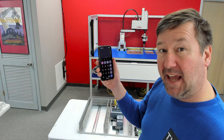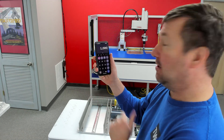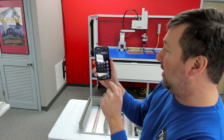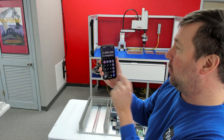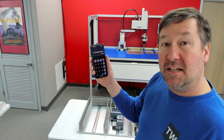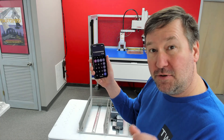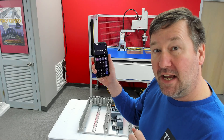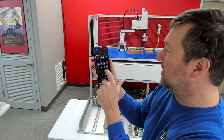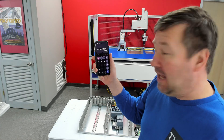In my case, I have a 1kVA transformer — that's 1000 volt-amps — and I'm going to be running at 240 volts. I divide 1000 by 240, which gives me 4.16 amps. So if I only fuse the primary, I'm in that 2 to 8.99 range, and that means I'm going to multiply by 1.67. My fuse rating would be 7 amps.